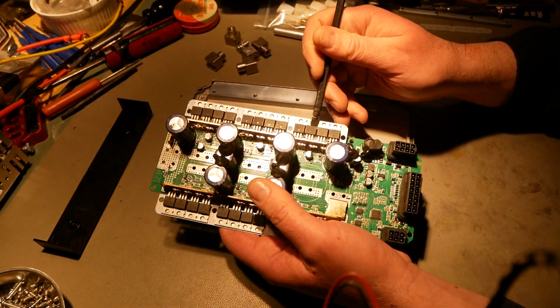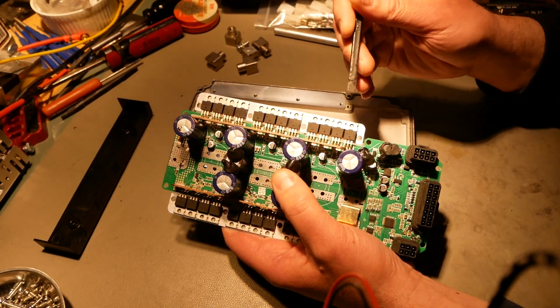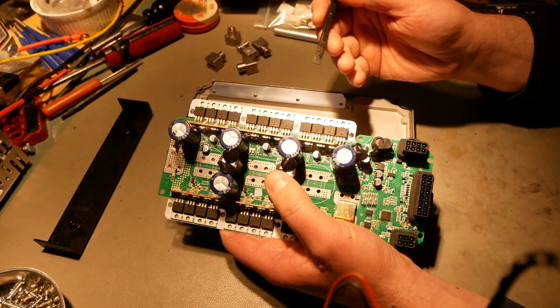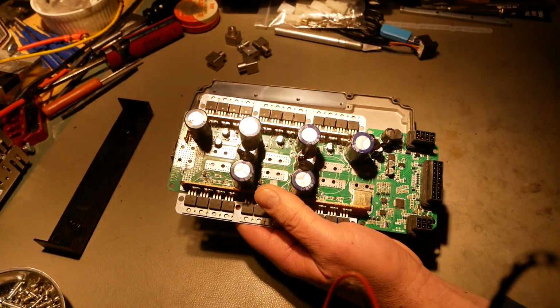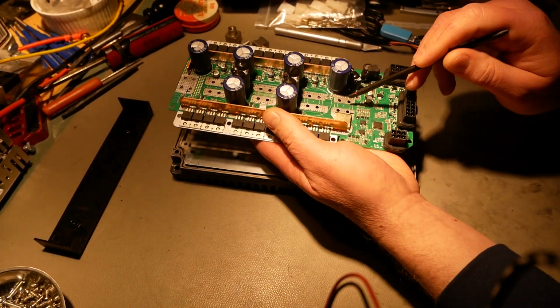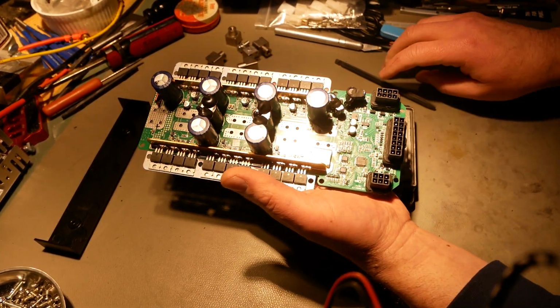I have not seen somebody do it just for that purpose before. Most of the time, the MCPCB is a current path and it's thermal. And this one here, no, they just said, we're just going to use it for thermal. That's it. All right, so right here, this is battery minus across those 2 sets of through holes.